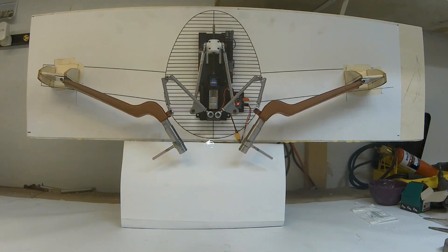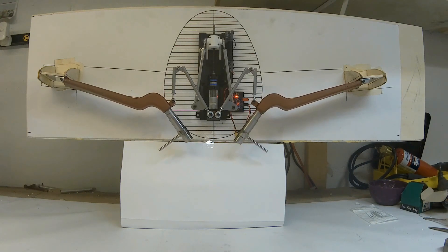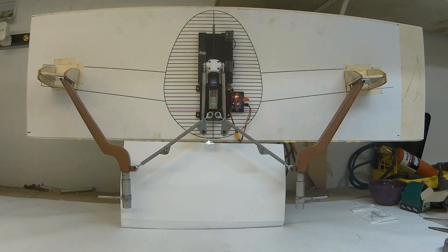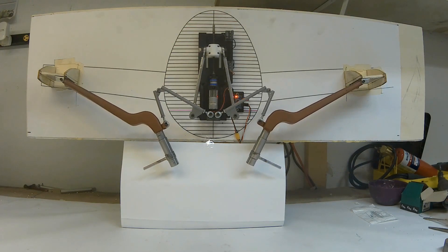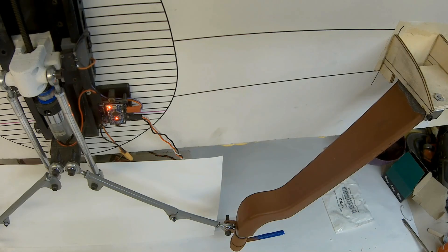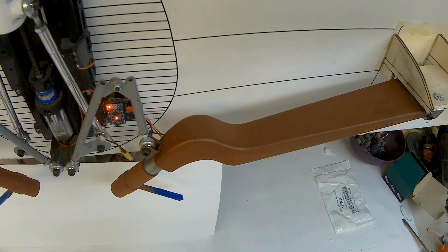This is the finished product — the one I did all my load testing on. I put five-pound weights where each wheel went to test it. I never broke or damaged anything. I did have one of my 12-volt motors start making a weird noise, but keep in mind I have a drawer full of 12-volt motors, some of them 15 years old. Once I swapped it out with another one, that went away. I really liked this next angle — I just wanted to see where the struts mounted to the wing, which is a really important geometry challenge.